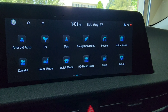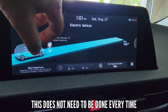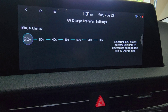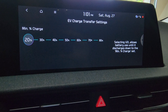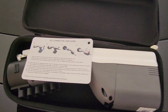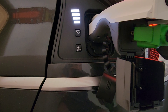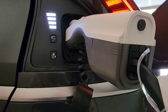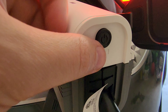The first thing you want to do is set up the vehicle to provide power. In the EV6, you go to the EV screen and then EV charge transfer, where you can adjust the minimum charge percentage when using the vehicle's load onboard generator function. This lets you adjust how low you'll allow the vehicle's battery to get while providing power to your home. Kia provides a 120-volt adapter with the EV6 — you plug it into the charging port, plug the power cord into the adapter, and close it up. Then press the power button on the adapter to turn it on, which activates the onboard generator.